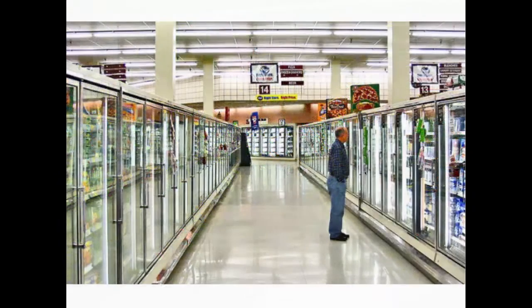And then go from there over to the frozen food aisle and feel the temperature there. You're going to feel real chilly in this aisle, but check the temperature of the air. It's 70 degrees. And Mr. Adlam, T. Napier Adlam, said that this is a phenomenon called cold 70. This is the feeling you get when the air temperature is 70 degrees, but the surfaces around you are cold, because your body is just going to throw radiant heat at these cold surfaces, and the body heat loss is going to make you feel uncomfortable.